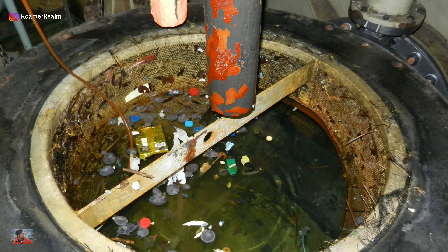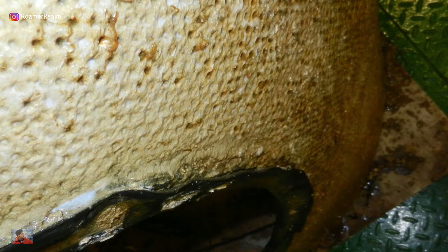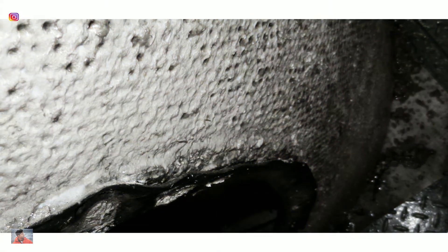The sea chest needs to be isolated and then depressurized before opening up for inspection. As you can see here, the high sea chest valve is open and the low sea chest valve is shut. In simple words, the sea chest acts like a gate, and through this gate sea water is allowed to enter the engine room through valves and piping in a controlled manner. But along with the sea water also comes a lot of unwanted marine organisms — for example fishes, planktons, shells and so on. These are problematic because once they enter the sea water system, they cause fluctuation in sea water pressure, and in severe cases they even cause erosion of the impeller on the sea water pumps.